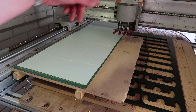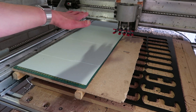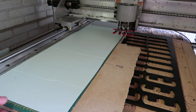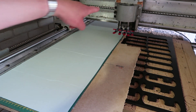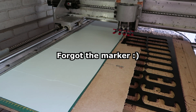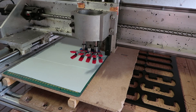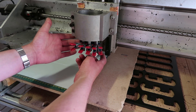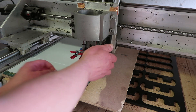This thing is sitting against this beam which I aligned with the y-axis, so I'll cut the first piece and then pull this back until I can align the zero point to a marker. But I just thought about it — I removed that marker, which is quite needed, so I have to put it in again. Let's change the blade: there's a 30-degree blade in there, but since this material is much thicker than what I usually do, I'll replace it with a 45-degree blade.